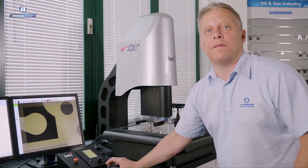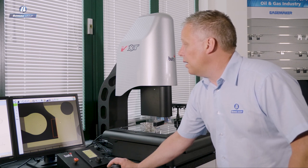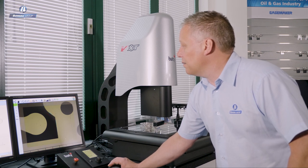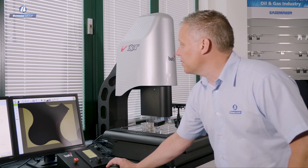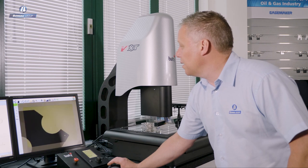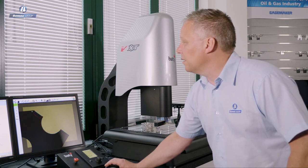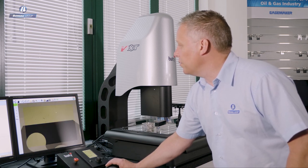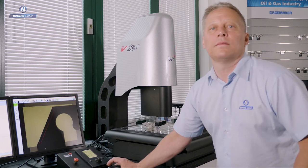That's a really convenient way of driving the machine around the part. Using the auto-select tool, I'm simply drawing boxes, and speeding things up using the mouse drag tool — not even having to complete each measurement, just drawing boxes. The software is making great decisions about providing the right tool for each feature. For simple parts like this, setting up the inspection routine is incredibly easy — if you can use a mouse, you can use Venture.